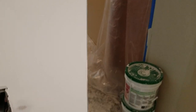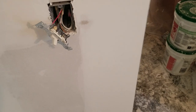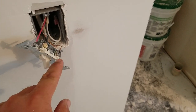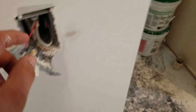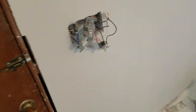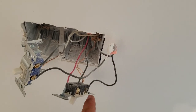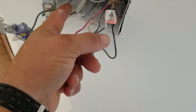Any questions, put them in the comments. Just remember: when you feed a three-way switch, the bottom lug is your power lug, and the top two lugs feed to your other switch. Main power comes in to the switch box, feeds the bottom lug, and those two top ones go to the other three-way switch — that's what talks between them. And remember, all your whites go together.